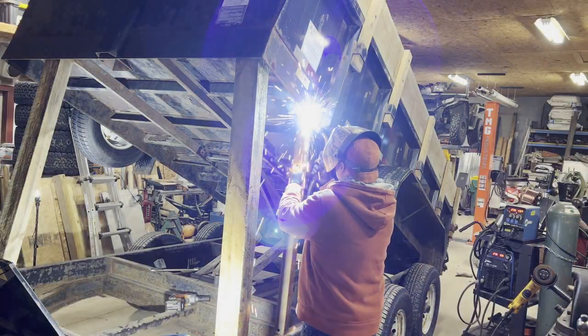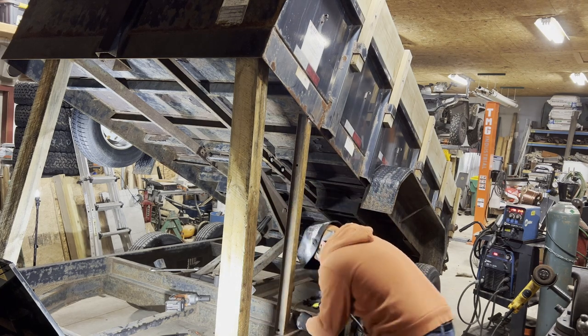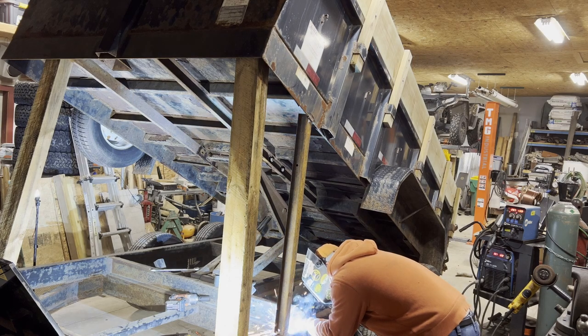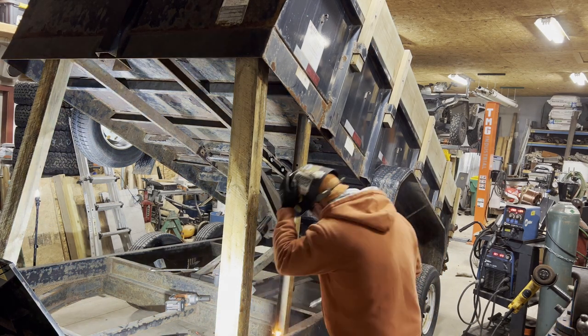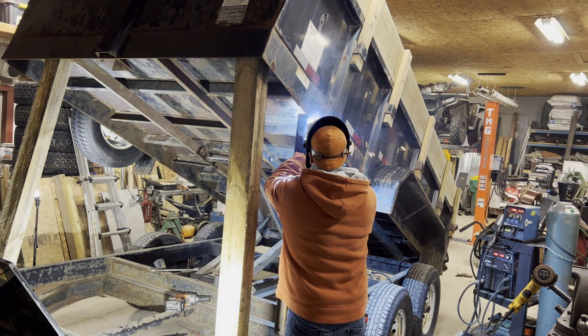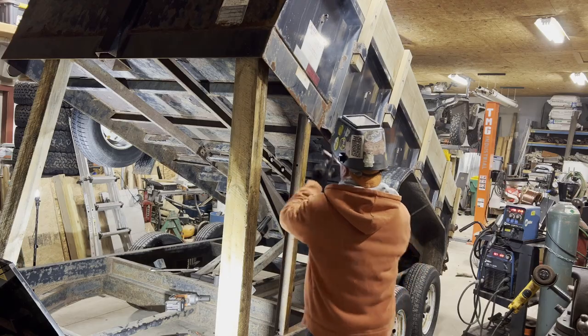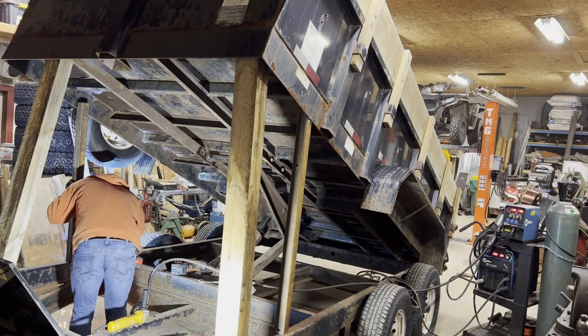I couldn't pound it out, couldn't twist it out, and had a hard time just pressing it out. And it really was only about a few inches that were binding up on that left-hand side. The right-hand side, like I said, looked pretty good. There was a little bit of rust on the shaft over the chrome plating. Basically, all the road grime and stuff that had built up between the pipes was locked in place. Outside of that, getting everything apart was probably the biggest problem.